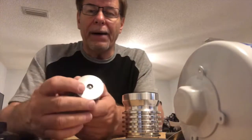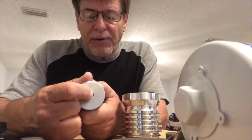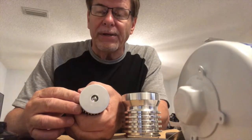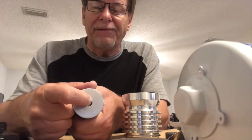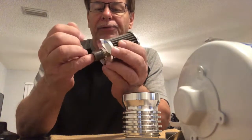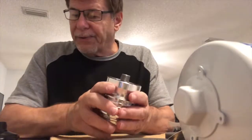This one also came with a bypass valve — you can get them with or without, but you certainly want it with. If for some reason the oil filter becomes clogged and oil is coming in, this is not going to be a choke point that starves your engine of oil. I want to say at around 15 psi that ball should push in so that oil can circulate right back out and on through to the engine — a good safety feature.